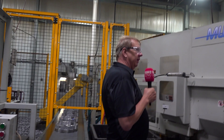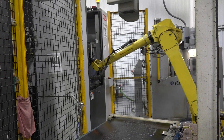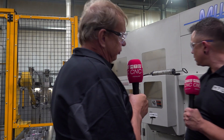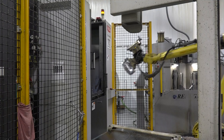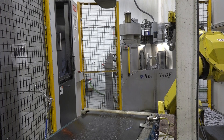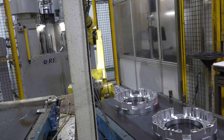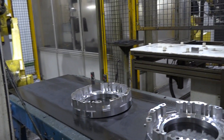The next stop after marking is another Fanuc robot which will pick up the part, orientate off of the IR vision system, and load it into the Toyoda 500J horizontal machining center where we do some secondary operations. After that, we take the part out and run it through a specialized wash system — a five-station rotary wash that actually washes, rinses, and dries the part. Every 20th piece is pulled out, placed on a slide table, and dropped into a CMM to get a sampling of the parts coming out of the machine tool.